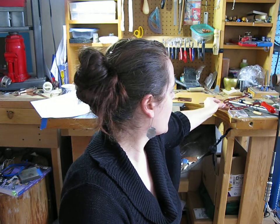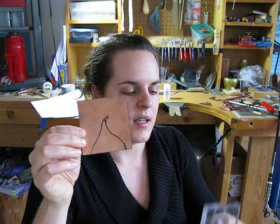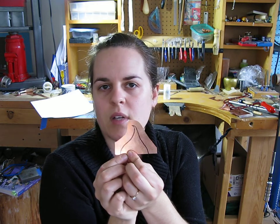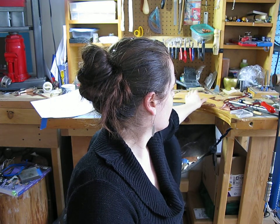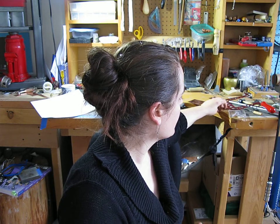So what I do is I get my sheet of copper. I've traced the thorn onto it, and then I trim it a little. I still give it some edge to pull in, and while I'm doing the pressing, so that it gets some volume. And then I'll anneal it. I will get it all lined up with this piece and actually tape it on there with masking tape to keep it centered so it doesn't move around unexpectedly. And then once it is pressed, I will once again trim it and sand the back so it's flat.